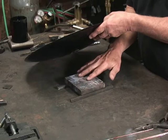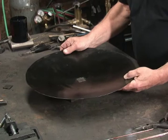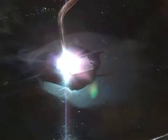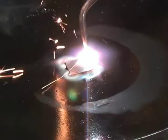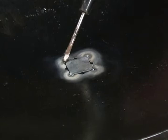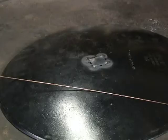It's got a heat sink right here — this heavy block of steel on top of these two three-eighths inch square pieces of steel — to keep it up off the table. I've turned the agri-disc upside down, and I'm going to fuse weld this eighth-inch piece to the disc. Fuse welding is just getting this one-eighth inch piece so that it melts, and the edge of this square knockout so it melts, and they just flow together. Just a tack weld, just to get it in position.